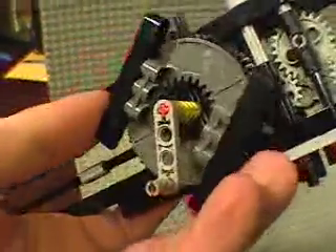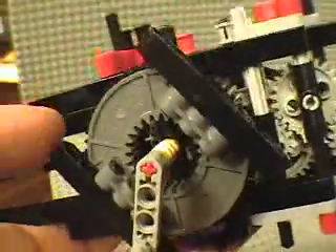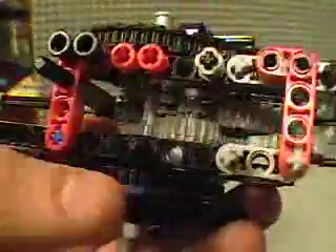This shows a design for a way to use multiple stacked turntables. The premise of this method is that each level is turned by the level beneath it, and each level contains all of the gearing to drive the level above it. A single central shaft provides the power to drive all of the levels. A large number of gears of different sizes takes the speed of that central shaft and converts it to a slower speed to run the level above.